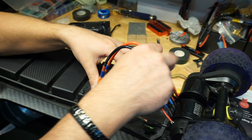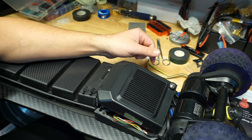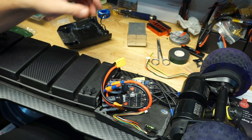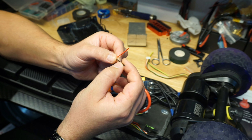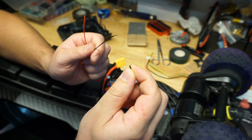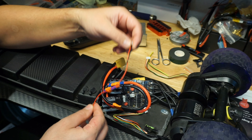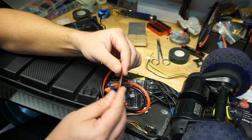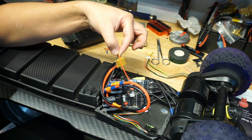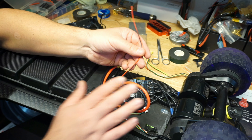This is how the wiring diagram shows it to be. Now imagine you're wrapping all this stuff into your enclosure, putting a cover on, and everything will be vibrating and working away when you're cruising and riding your board. But these cables are really, really thin — you can easily strip this cable just using a nail. The plastic coating on the cable is very fragile, so if this cable is lying inside your enclosure and rubbing on something, there is a potential that these two cables could connect the positive to the negative.